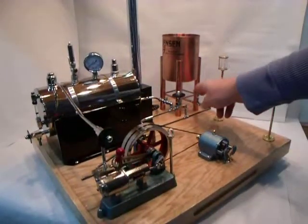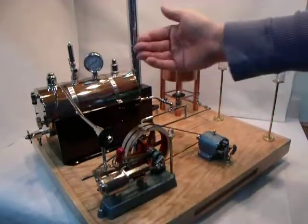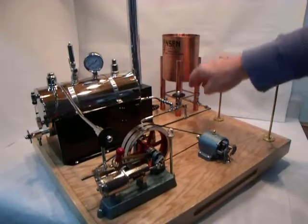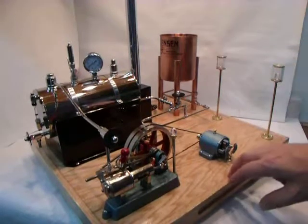Let's talk a little bit about the plumbing. We've got a shut-off here so that when the engine is shut down, the capillary action of the boiler starts working — it will actually suck all the water out of the reservoir if you don't shut the valve off. A lot of us have experienced that. You need to drain it down, like I did just about an hour ago.